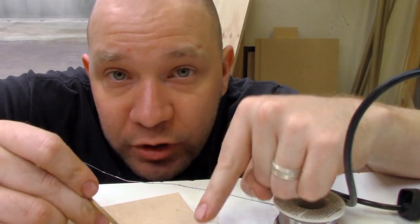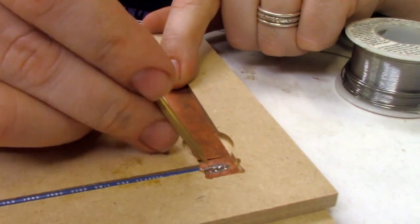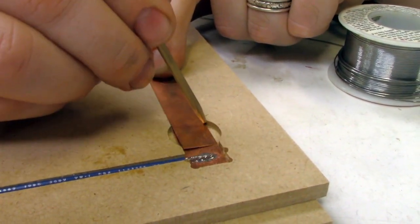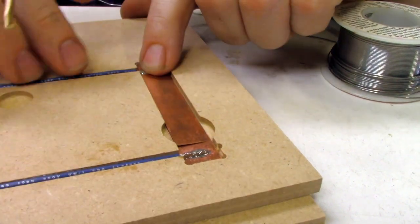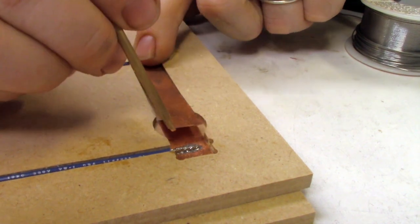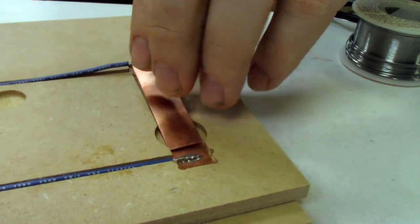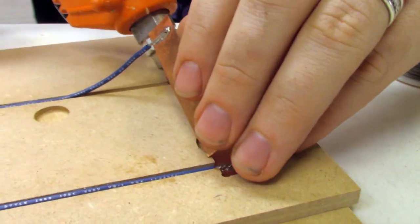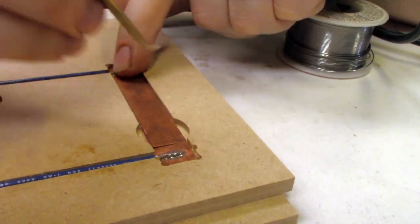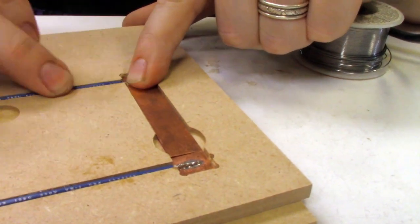When I'm gluing these guys in place, I have to be very careful to have them lined up straight up and down, because if they're canted off to one side it's going to rub on that and can prevent 100% accuracy on the switch engaging. If it's flat back it might get caught on there. So a dab of glue, and nice and straight up and down.